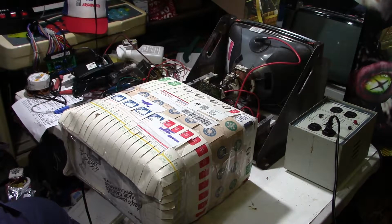Well, today we're going to start part 2 of this K4800 monitor. We're trying to see if a repo flyback for a 4900 will work in the 4800. And in the first video, we kind of had mixed results. While it worked and we were getting a picture, I couldn't see any neck glow, and the screen voltage had little to no effect. Had a slight effect, but it's kind of iffy. It's like it almost isn't even doing anything.